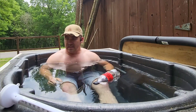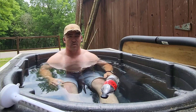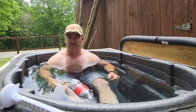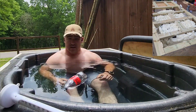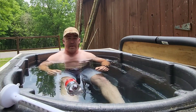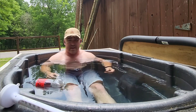It's been doing really well. I don't have a problem with leaks because I followed the plans carefully. It's a 150-gallon Rubbermaid tub; the lumber composing the bottom is treated lumber since it gets the most moisture, and I've got a moisture barrier wrapped around it. There's a rubber mat on top, wooden decking on the sides, insulation, and the tub itself has been insulated with about 12 cans of spray foam. I shut off the pump and chiller to test retention — it only gained about half a degree per hour, which wasn't bad at all.